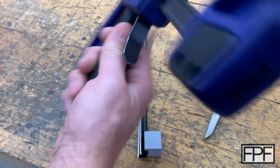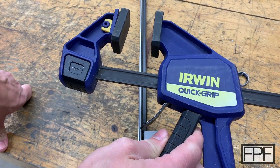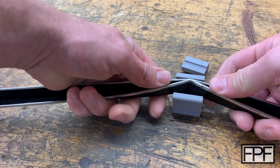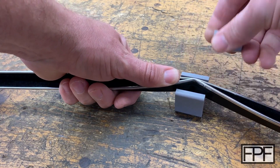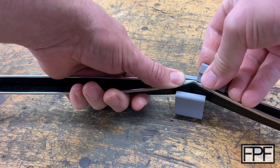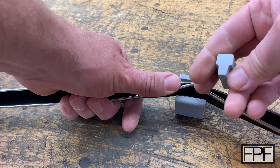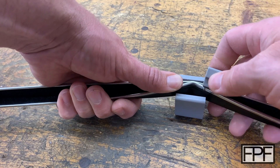Okay, I'm going to try with just a clamp first. These Irwin quick grips apply a pretty significant amount of force. And if that doesn't work, I've also got a bench vise here and I've got the hydraulic press as well. What you can't see is the two ends that are like three feet long flipping all around here, making it really difficult to keep this in place. In hindsight, as I stand here trying to force this into this piece of sheet metal, I'm realizing we could have made a couple of different stages of inner dies — started with one that came down almost to a point to force this guy open and then worked our way up to the final shape. But I'm going to keep going.